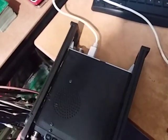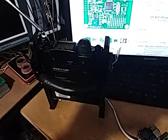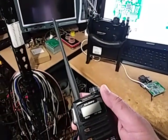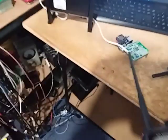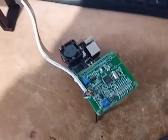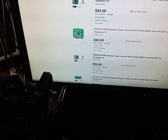The modem here has audio output which I feed into my FT-817 — the little Yaesu — going into the packet modem input, so it's audio straight in. When this little unit is on packet it becomes the radio, instead of just a chip being the radio — the whole transceiver is the radio. That gives me greater range. This type of board is called an HS hat. It's not to be confused with another type of modem being sold online.